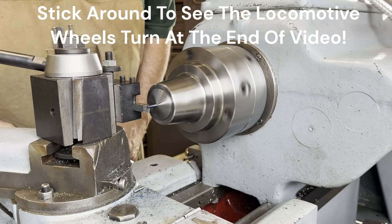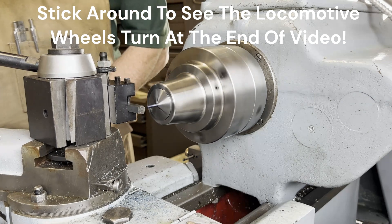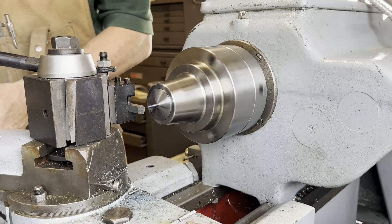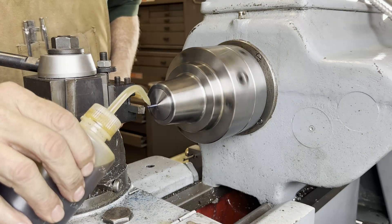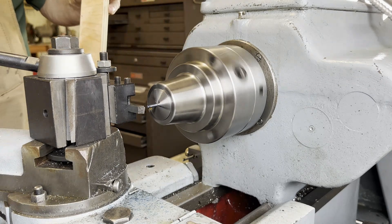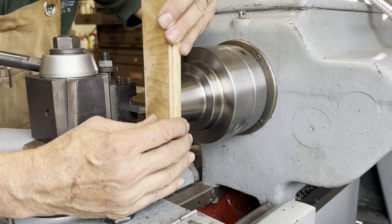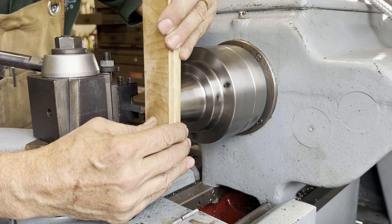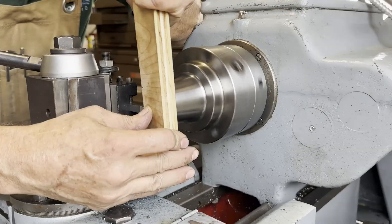The first 12 studs went really easy for me — everything worked as expected. But then I had to order some additional material, and evidently the new stainless steel rod was much harder and more brittle than the previous rod had been. So I resorted to using a backer board as a crude follower in order to keep the studs straight as a single point threaded them.